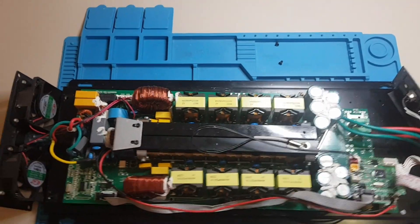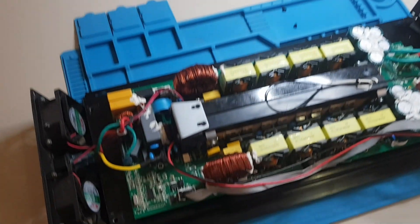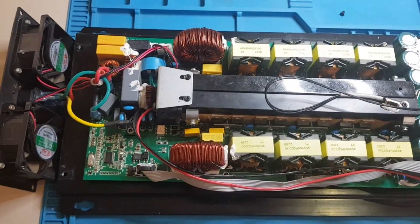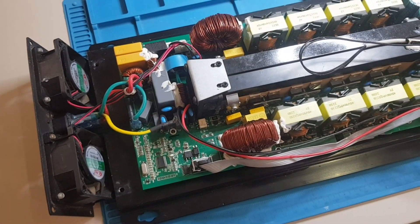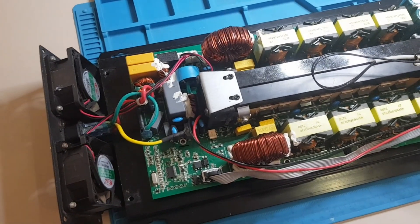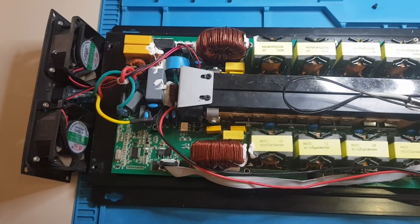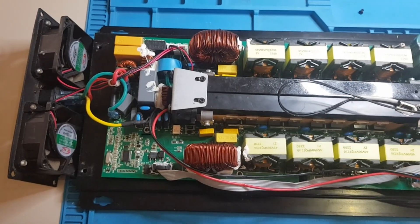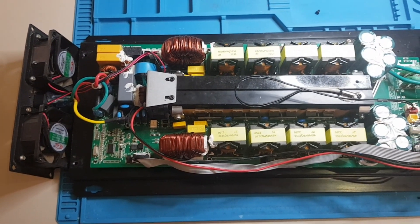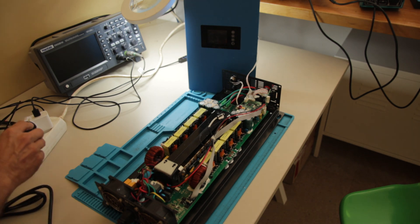The only thing I could not fully verify — I tested some signals with my oscilloscope, but at that moment I did not have the IGBTs built in yet, so it was showing different things than a working board would show. Especially on the AC sensing inputs, I think this was because the IGBT was not built in, so there was no ground reference from the high voltage circuit. We will see that in a moment. I've opened the lights in the back so you'll immediately see when the circuit breaker pops — this is the plug, this is the socket. Let's see what happens.